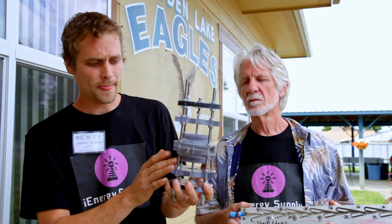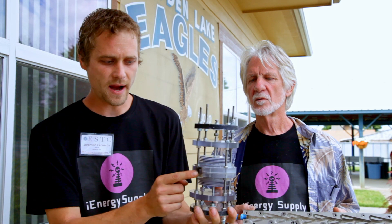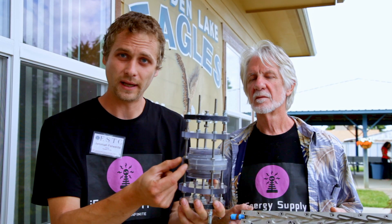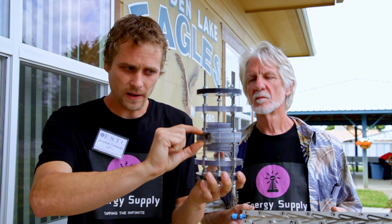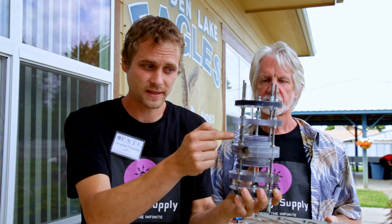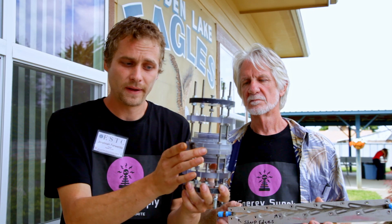One of the differences you'll notice is that with a regular Tesla turbine, when you rotate the shaft and disconnect the air supply, you're going to have air blowing out the intake, and that's a bad thing. You want it to draw in naturally without putting any initial pressure inside of the turbine. This is a two-stage Tesla turbine. The center part is a regular Tesla turbine, and on the same shaft we added stage two, which is the top and the bottom discs. When you rotate it, it creates a lower pressure inside the turbine and actually draws in ambient air.